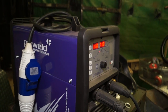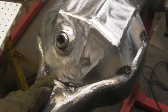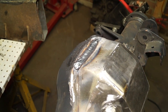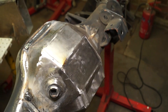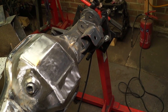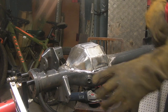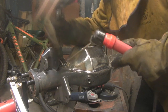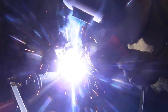I've turned the welder up to 110 amps because I want as much heat as I can get into it. I experimented early on. What I've done is tack on the corners. After that, I've welded one side and turned the stand around to accommodate it, then did both sides opposite to each other. This is the way you need to go — do one run of weld, then do the equal opposite to it. This way it will pull itself square all the time.